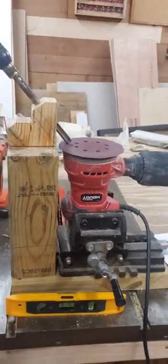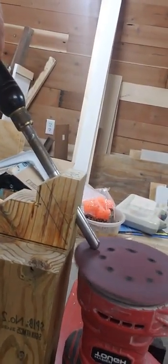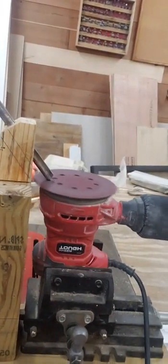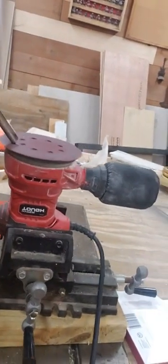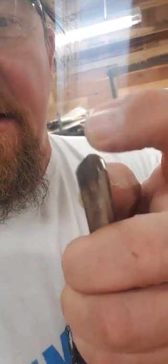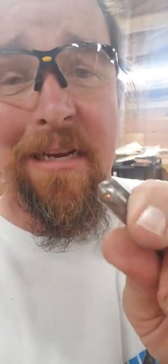Let me kick it on and show you how it works. Try to keep it going without stopping so you don't end up with flat spots in your chisel. Just go back and forth nice and smooth so no area gets very hot and you don't get any flat spots. Back it out, feel that edge — and looky there, I've got a nice little sharp edge that will cut right nicely for a little while.